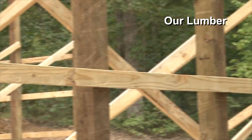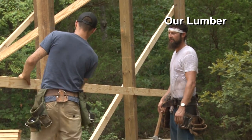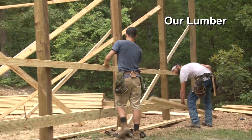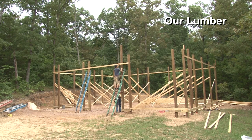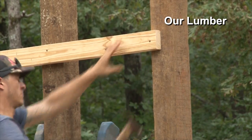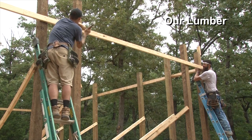A few factors to consider — number one would be cost. These are 16-foot columns. As far as girth and equitable strength, a laminate column is going to cost a lot more than these. If you get up to 19, 20, 22, 24 feet — you start getting really long, and try getting a timber that long. Usually another dynamic is when you get that long, you also have more wind loading, so you're getting into bigger and bigger columns.